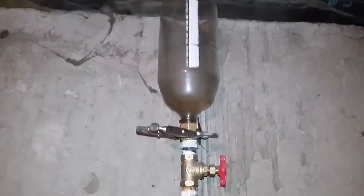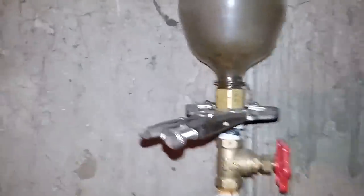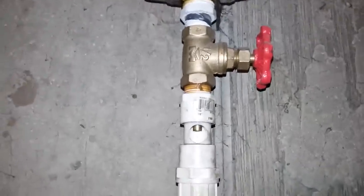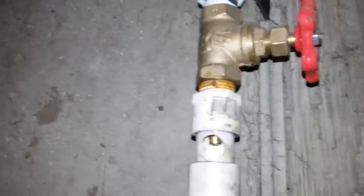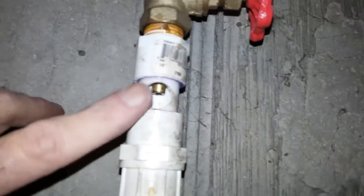I got a two-liter bottle which threads into a three-quarter inch pipe thread fitting right up there and it seals pretty good. I made this little sight drip deal so you can see inside the PVC. I can turn the valve and then you can see the drip feed rate going down right there, and then it just gravity feeds down through that hose.